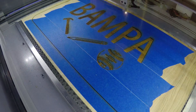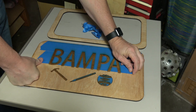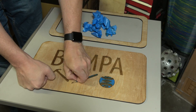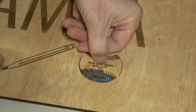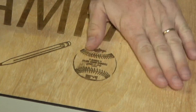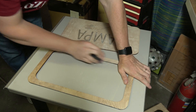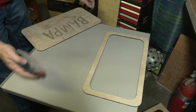You can see me scraping off the blue tape. The reason we put blue tape on the wood or acrylic when doing a laser engrave or laser cut is because the blue tape keeps the edges clean. When you're engraving or cutting, the edges get marred or burnt — they get embellished a bit. The tape actually keeps that residue from getting on the wood or acrylic and makes it go on the tape instead, so when you take off the tape your wood is clean. I am sanding this even though I put the blue tape down because I wanted to freshen up the top of the piece — it's plywood, it's been moved around and transported, so I just wanted a nice fresh clean top layer for the stain to go down onto.